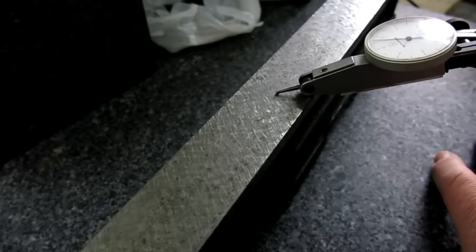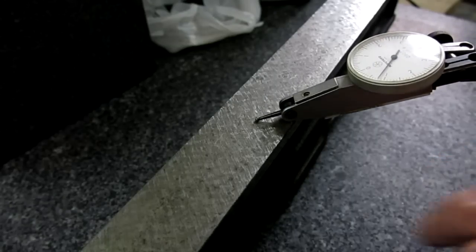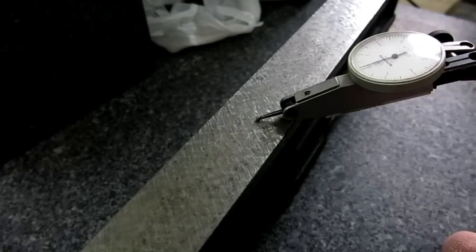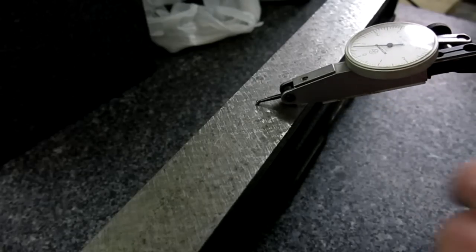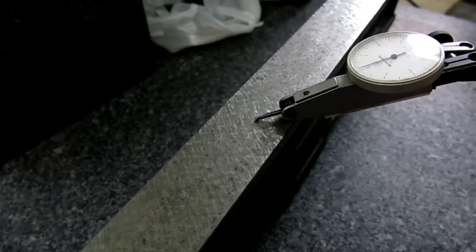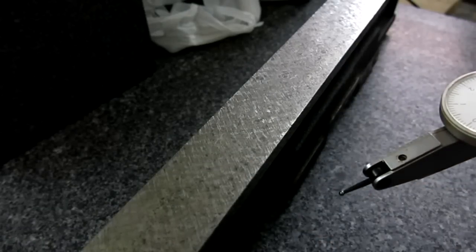So you can drive around and find some small localized spots. Yeah, there's a thou right there. See, look, maybe you can see that, but at the tip of the indicator, there's a little dark corrosion spot, and when I drop into that, the indicator goes diving away. So really, I need to get those little dark spots out of there. But I had fun, and we scraped our brains out, so thanks for watching.